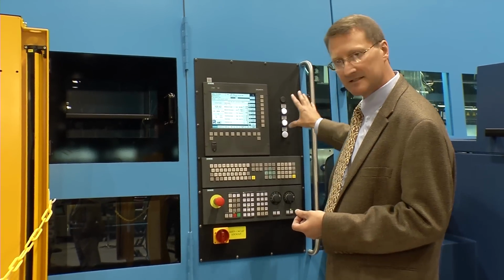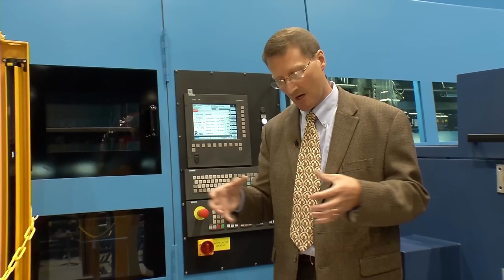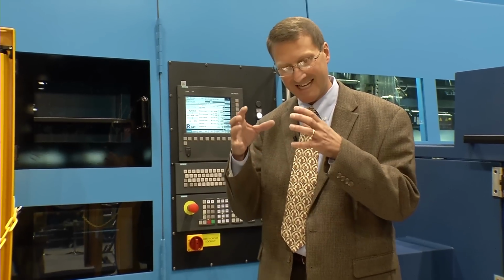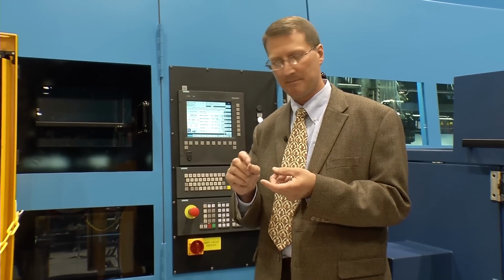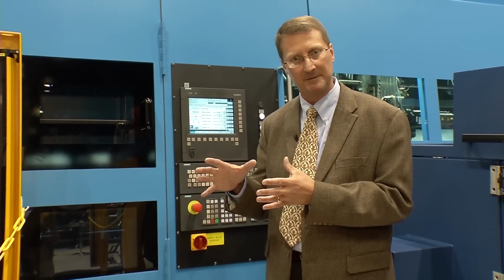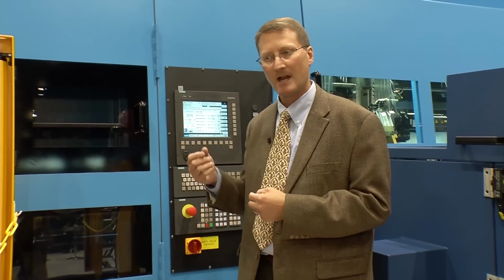The sawing process is behind this panel. We're clamping the tube with the same idea that we use on the grip feed. We're clamping with a pre-programmed clamp pressure and clamping force. We're looking for those saw clamps to come to an exact position. Again, detecting the possibility of a chip, a bit of debris, any number of things. If the clamping situation is not exactly perfect, we won't make the cut. Assuming everything is good with the clamping position, the saw blade is going to travel down, it's going to rotate.